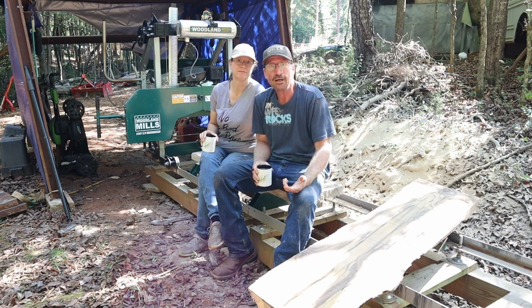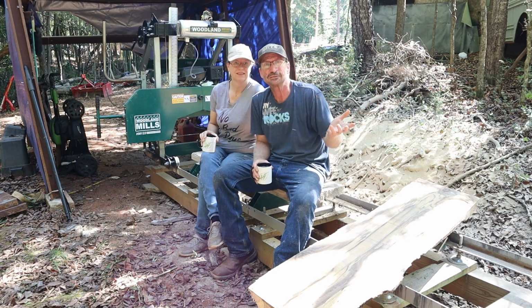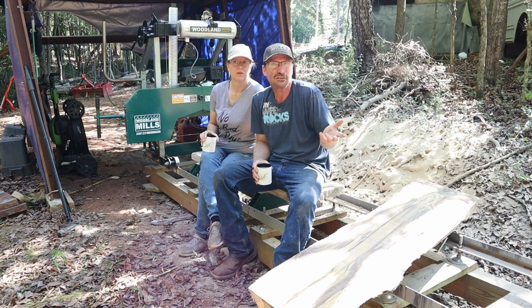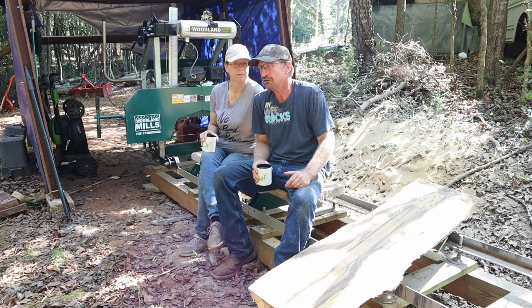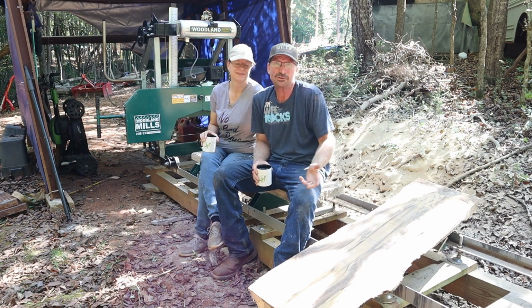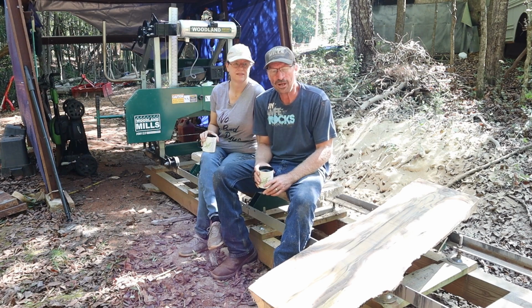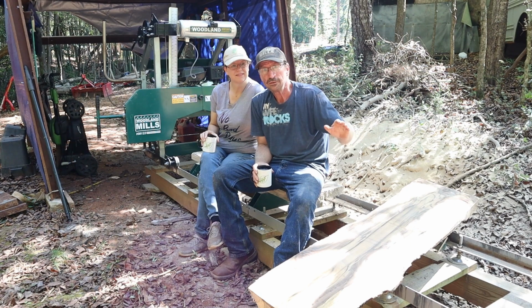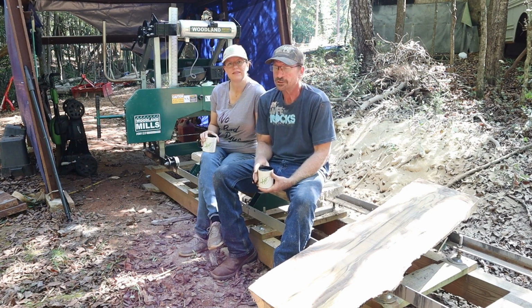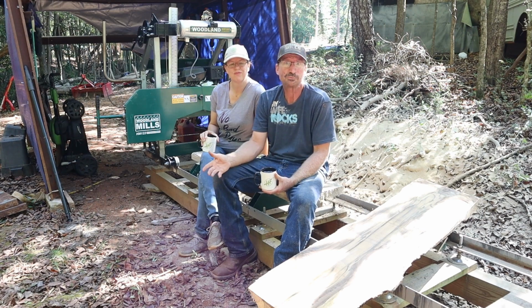I should have bought hardwood, but I've got so many little pines and stuff out here, I didn't think I needed it. Pretty much cedar, pine, and sweet gum. And the cedar's kind of hard, so I should have got hardwood blades. I'm going to do that next time. This blade could be a little dull, so if you push it slow, it'll make it through. So there's one point: probably just get some hardwood blades, that way you're always prepared.